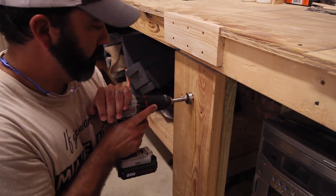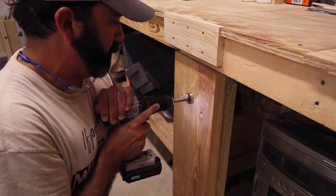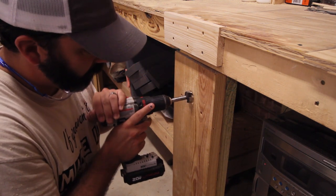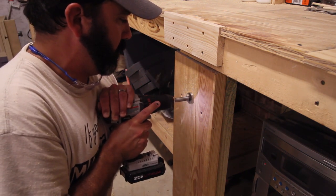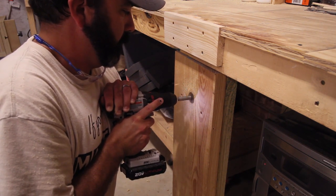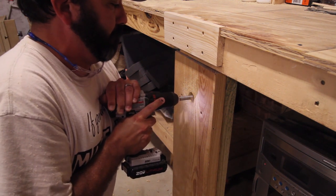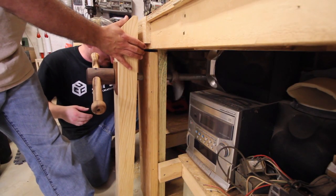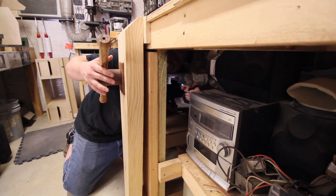After some careful measuring and marking, the screw hole can be drilled out. We position this so that once the vise is closed, the top of the vise will be a little bit proud of the workbench surface — it's better to be proud and plane it flat than to be too low. This hole goes through the front piece of material we added, right in between the two legs behind it. Once the hole is drilled, we can install the vise, thread the nut on from the back side, and secure the nut with a couple of wood screws.